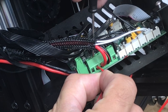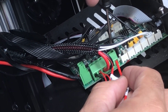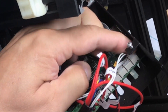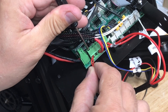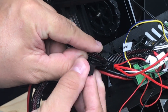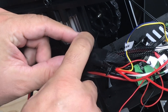The first step was to connect the cooling fan and screw it into place — I actually got the wires backwards and had to fix that. The next step was to put in the hot end wiring; these terminals really shouldn't matter which way they go but it showed positive to the right. Then I connected the thermistor and finally the filament cooling fan. I had to swap the fan connectors since I'd gotten them backwards, so double-check your wiring before you power it up. Once that was in place I re-taped the wiring with electrical tape where I had cut before — two strips wrapped around it held really well.